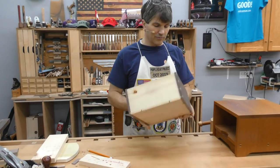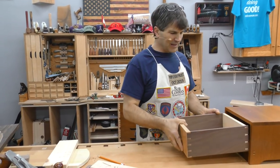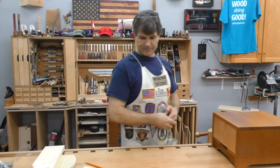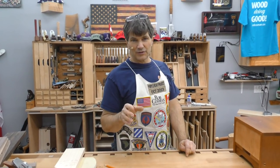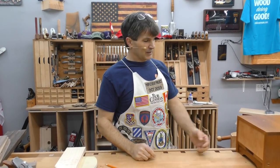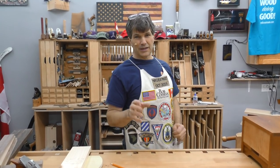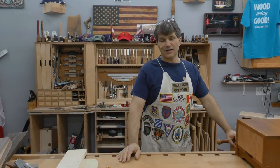Then you know you're going to get the fit you're looking for. Any twist, you can't get rid of it — in the process of trying to get rid of it, you're going to lose that perfect fit you're aiming for. It takes some work, but it's a lot of fun and very satisfying. You've got to be careful and you can't be in a rush. Make sure your materials are good and dry. It's always nice to use quarter-sawn lumber if you can find it for your drawer sides — anything that will minimize drawer movement. Anyway, that's drawer making in a nutshell.